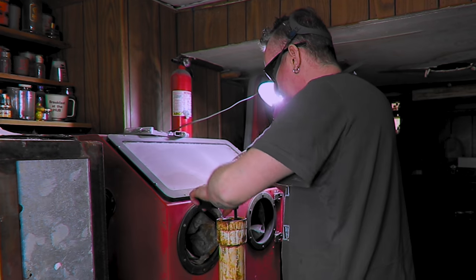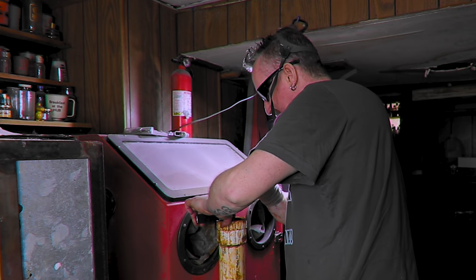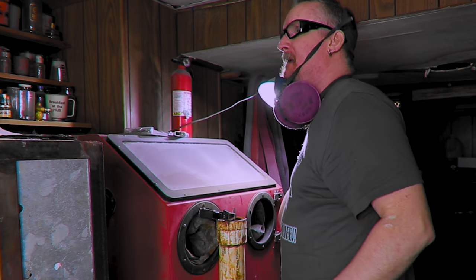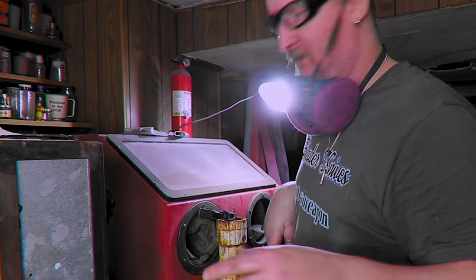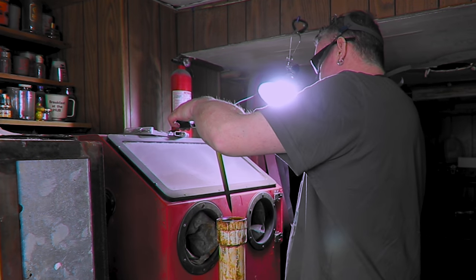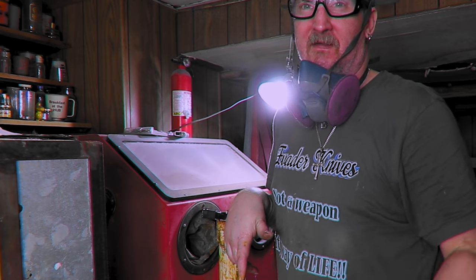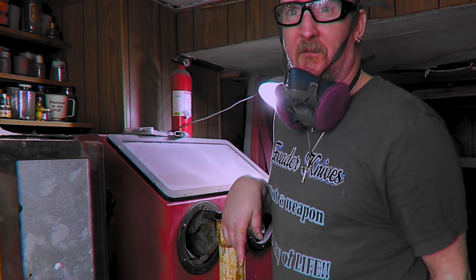Now we'll take our clamp. Boom. Make sure we're in all the way. Bam, I leave it in for probably 2 or 3 minutes, nothing special. Maybe I'll pull it up and dip it a few more times, but check to see the darkness. The vinegar really makes it dark. Now I'll go and neutralize it and meet you back at the buffing wheel.